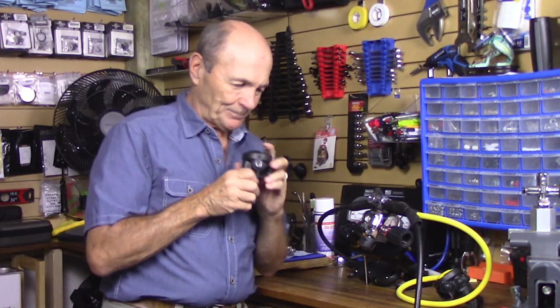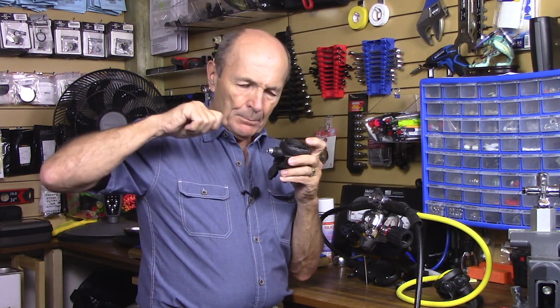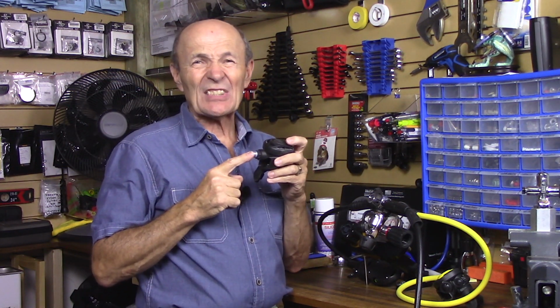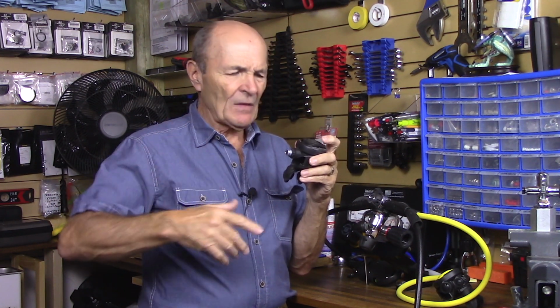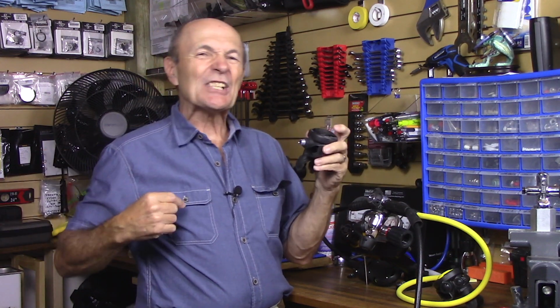All right, here we go. When you put a screwdriver or the proper tool onto this fitting, push it in, and you turn that white plastic. That's actually called the seat. That's the hard seat. There's 2 seats, hard and soft. And when you turn that seat, you increase or decrease your breathing resistance. If you turn the seat counterclockwise, if it's screwing out, it gets easier to breathe. If you turn it out too far, it actually free flows. That's really easy to breathe. You can't get any easier to breathe than free flowing, right?